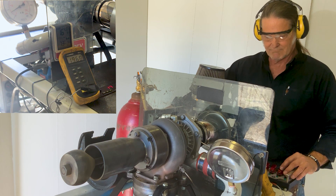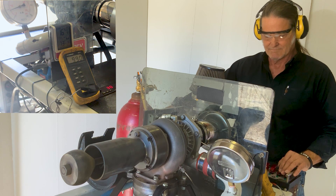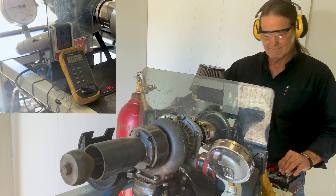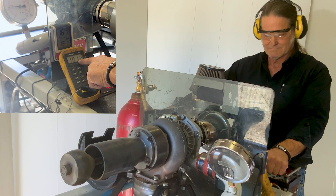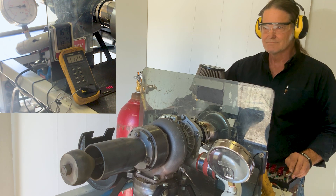We're at 1,800 to 1,900 degrees at 22,000 rpm. This temperature will start to drop because of the air coming into the combustion. So 30,000 rpm — the temperature is dropping. We're at 1,000 degrees. Now we're at 40,000 rpm at 960 to 980 degrees. I'll hold it there. We're below the 2,000 degree mark so I can self-sustain and run it for quite a long time.